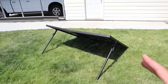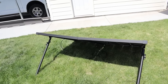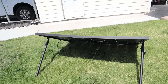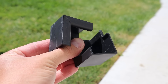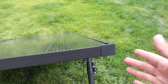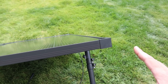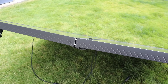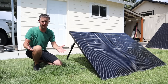With the latch connected, the solar panels are in a much straighter line — much better than when it wasn't latched and you had a big V with both panels facing different angles. One last note: to install this latch you do have to remove the plastic protectors on the corners. They just pop right off — they're not glued on. I do like that this solar panel has those, but you have to remove them to install the latch.